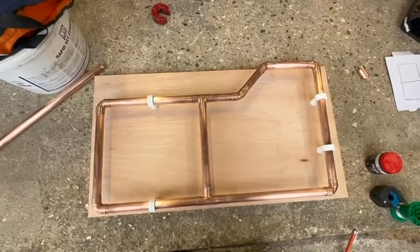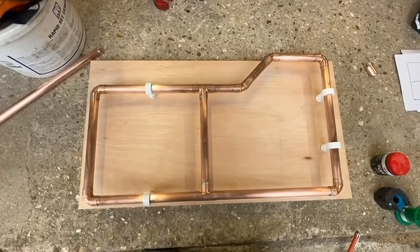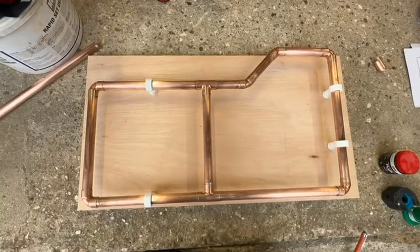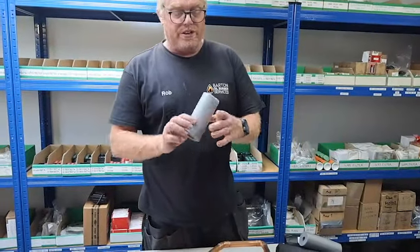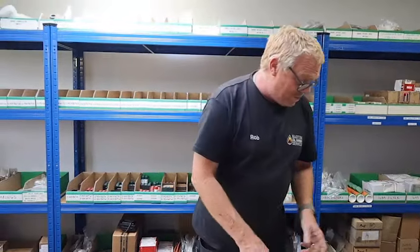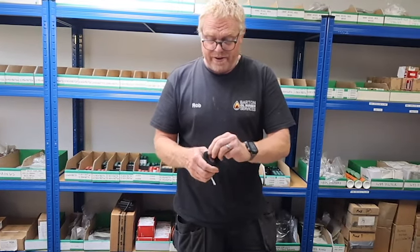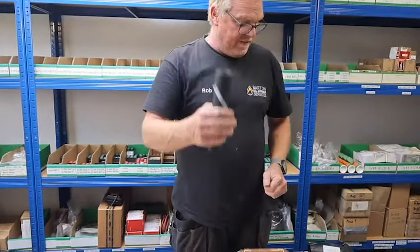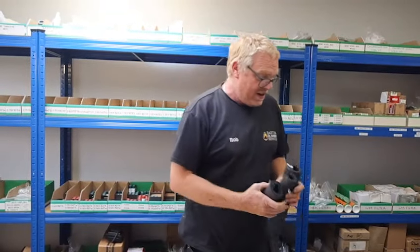It's all cleaned up, clipped to the board. I'm going to take you to the office tomorrow where Isabel will be on the proper camera, and I'll show you how to insulate these pipes and the best procedure. I know there are many different versions and ways people do it — some will say my way is wrong — but it works for me. So here in the office: the insulation we carry includes 22mm and 28mm with quite a thick wall, a thinner 13mm wall version, 15mm thick wall, and then armaflex for exterior use — it's a lot harder to work with but you can peel these off and it self-seals, which is why I use it outside. We also carry it for condensate pipe.